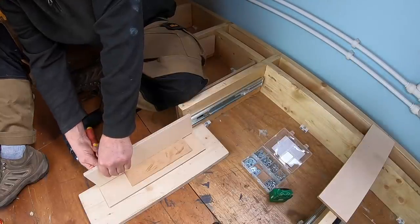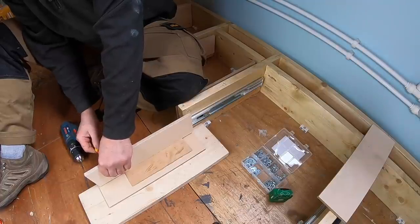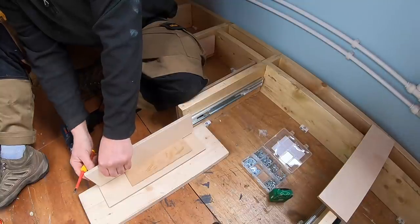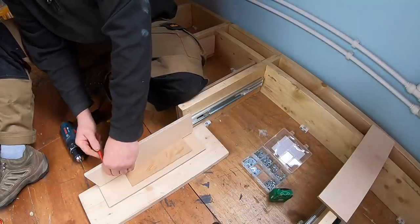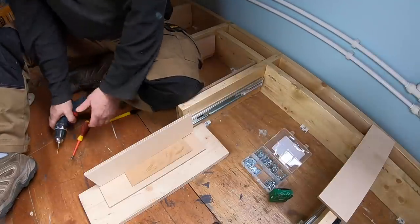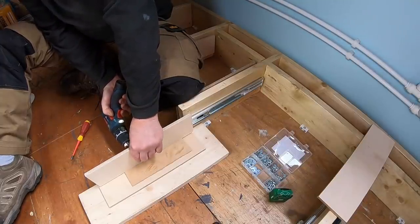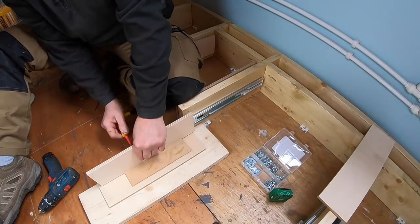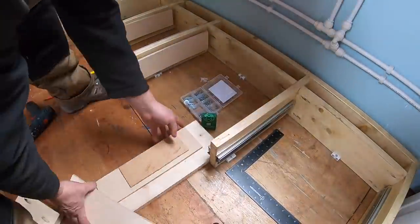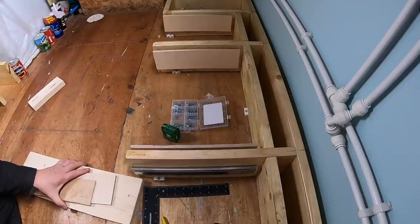Yeah, the reason why we're having the blocks on underneath is to make sure that the drawers will open once we get the main floor in down, hardwood floor. Yeah, so it runs over the top of them. Obviously we'll just set the drawer fronts to whatever height we need then, won't we? Yeah, it'll fit in like a kickboard. And they're flush up to the edge now. So just repeat it down to the next one there now.